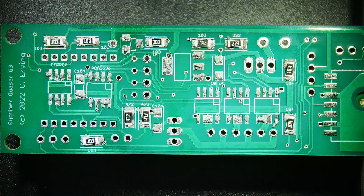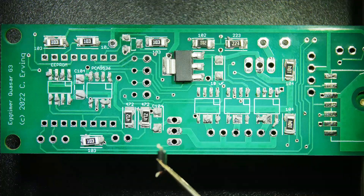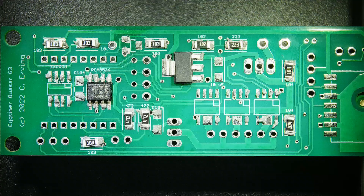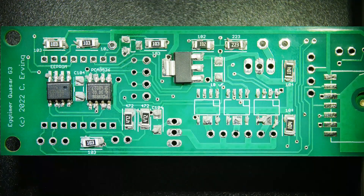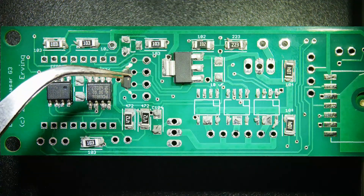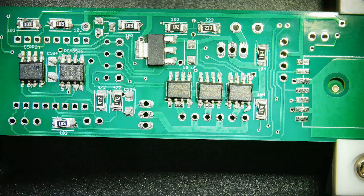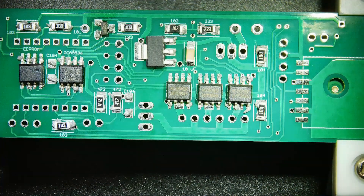Find our regulator, let's put him down. We put down the PCA, and we've got the bevel on the top which will indicate pin one. Let's find the EPROM, put that down. Let's throw down those drivers - we've got the bevel on the top. There's one of these small three-pin packages, let's just set him down. Brown parts in clear tape - that's going to be our 10 microfarad. I see 104 is the 0.1 microfarad cap and that is a brown part in white paper.